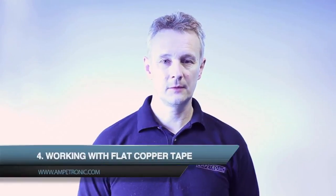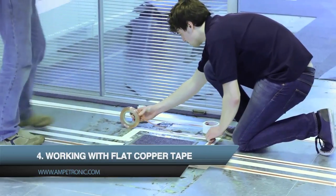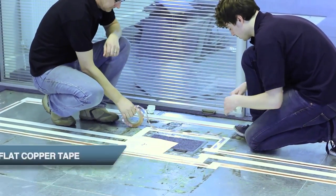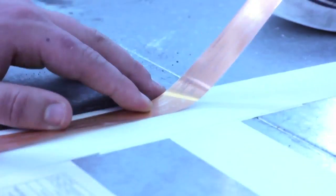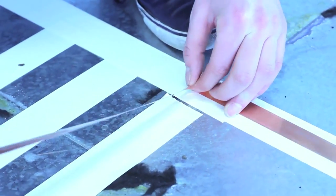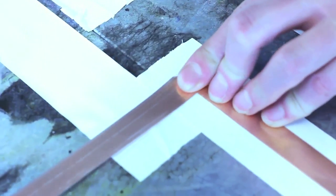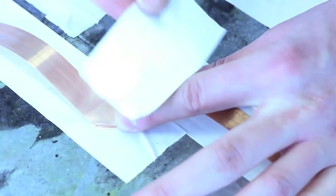There are two main benefits for a flat carpet tape. The first is that it is very flat and it will go under carpet and vinyl without leaving a visible bump. The second is more for our own benefit: it has lower inductive resistance, therefore we can put more tape and have longer runs through the amplifier. Also for laying the loop it's very easy to fold around corners, again without leaving a visible bump.